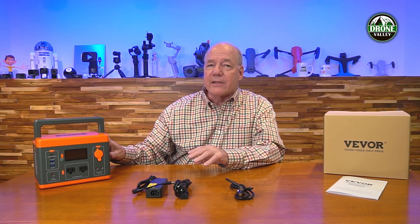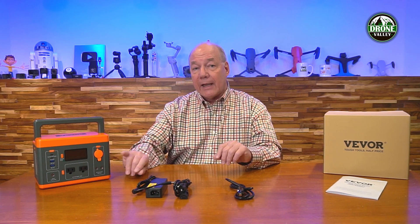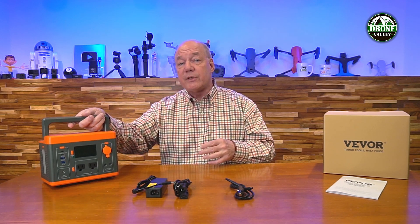The unit has an incredibly important battery management system built in — that's the governing circuit that handles inrush current to charge the batteries and distributes it across all the cells inside. It's also the same circuit that protects your external devices when plugging in your phone, tablet, and other portable devices, ensuring they charge safely without damage. It has over-current protection, over-voltage protection, and over-temperature protection, all constantly monitored. There's also a cooling fan on the side — when you use the AC portion and the inverter turns on, the fan activates to cool everything down.